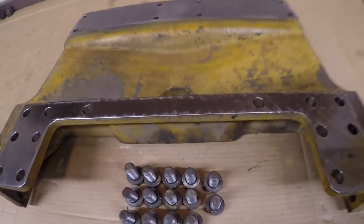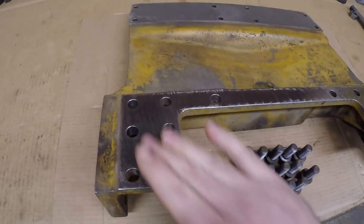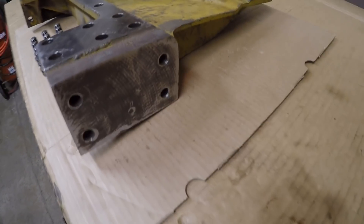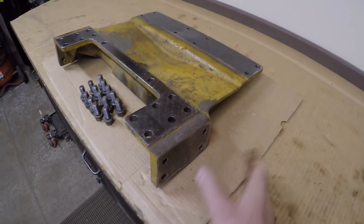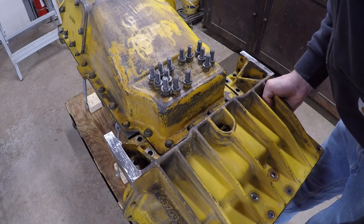Now we can put the radiator support on. There are 14 half-by-13 bolts that hold this thing on all the way around. Of course it is a structural component — not only does the radiator perch way out there, but we have half-by-13 threaded holes on each side for attachment points. The crankcase guards, the skid plates if you will, would attach to those areas on each side — also handy for putting lifting eyes for slinging engines. They had to build quite a bit of support into this thing with lots of gusseting on the back side. Quite a substantial piece of cast iron — nothing fancy about this install, just set it in place and bolt it on.